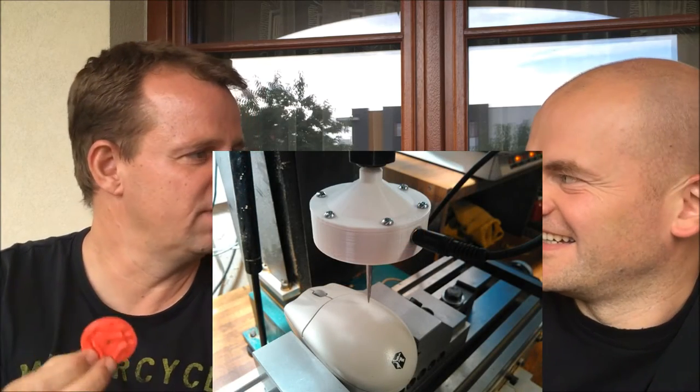I also do 3D printing — we have some bad examples here. It's an interesting thing; I want to show you the pictures. It's a corner sensor, you can call it a touch sensor. It's a CNC probe for non-conductive elements. So you can probe plexiglass before you try to engrave it, for example with a very low depth. Or you can probe anything like a computer mouse and then engrave your name on it. You can also engrave glass and check the surface first — even if it is not flat, it will just follow the surface for you.